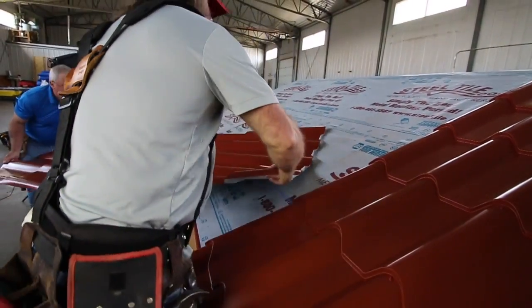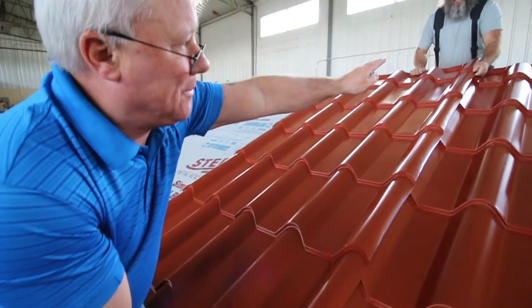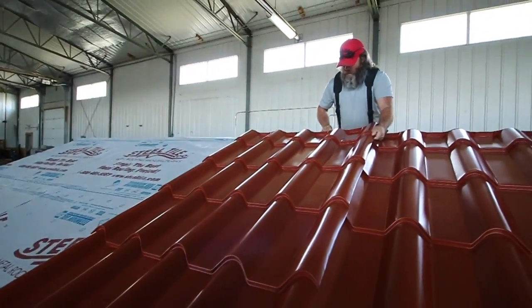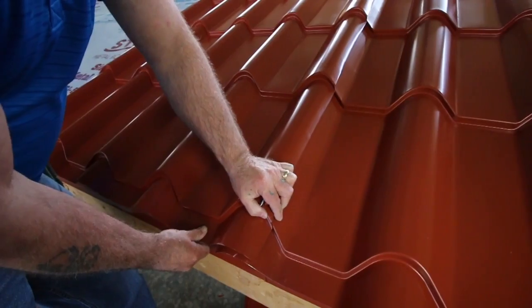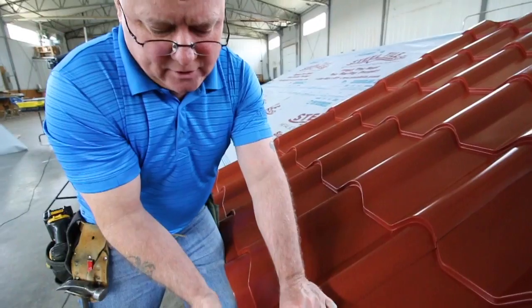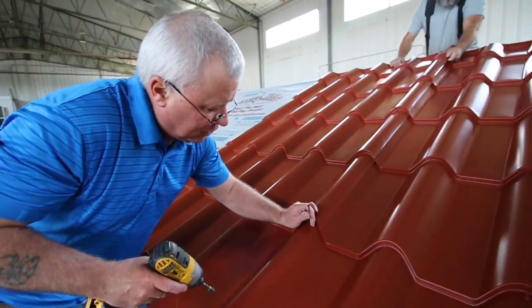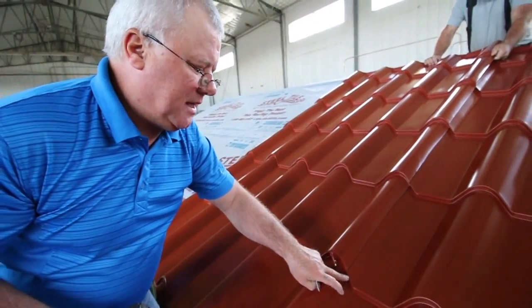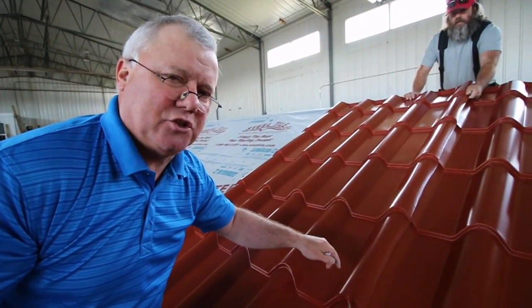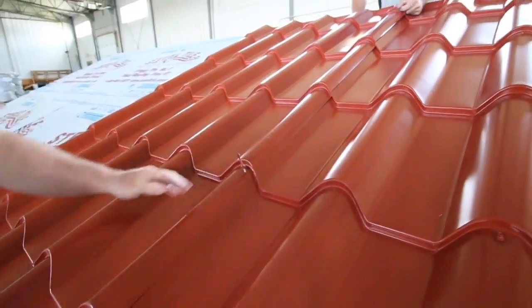When installing your second panel, with a couple of screws in the first one to hold it, take the second panel and hold it up a bit above position — your helper at the top of the roof keeps his hand there to hold it up. Try fitting the bottom in first, then slide the panel down. You'll notice it's flush from one panel to the other with a tight step. Place your screws to stitch the panel together — stitching just means screwing the two pieces of metal together, not going down into the strapping or plywood decking.